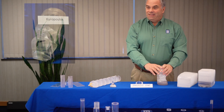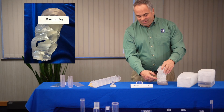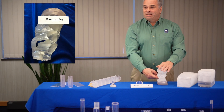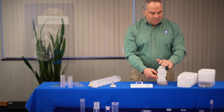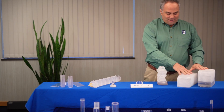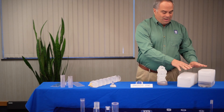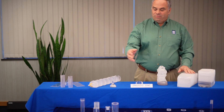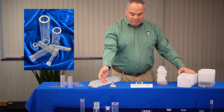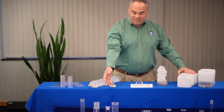Additionally, we have the Czochralski technique where we are going with a very specific orientation. And then we have the heat exchanger method. The heat exchanger method is another technique in which we get very good optical quality material. And this optical quality material can be used for infrared countermeasure devices. We have some parts here that were for left ventricle assist devices.